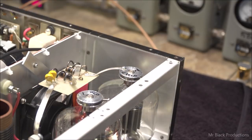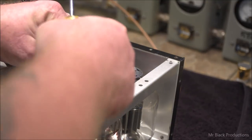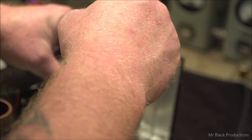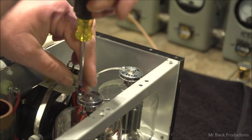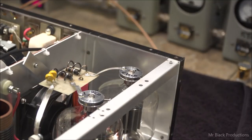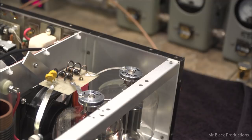I'm not joking. It makes a huge difference, those caps, in just overall operation, energy dissipation, heat dissipation off the top of the anode. And you know, when you keep your tube cooler, you can get a little bit more poop out of it for a little bit longer. Just saying. And I'm not just talking in the short, oh, we can get 20 more watts out of it. I'm talking overall the life of the tube. Okay, dead man switch is thrown back.